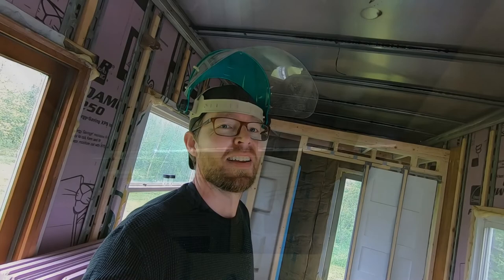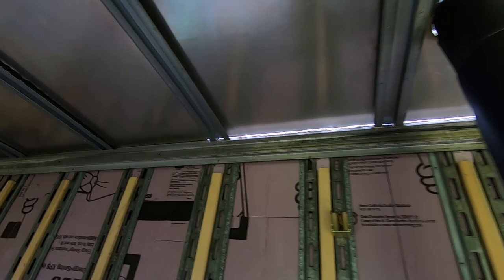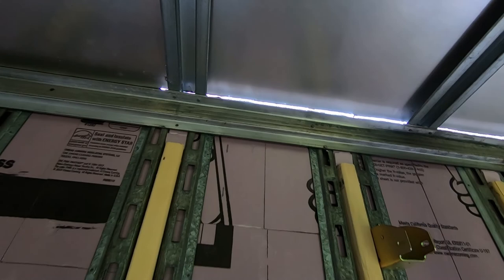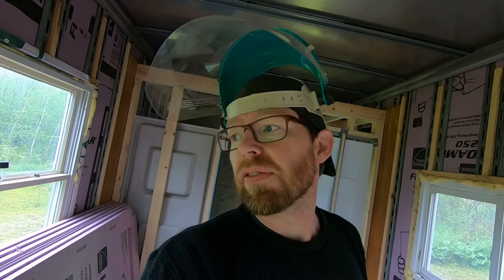You know that temporary business that I did and said earlier? Well, the temporary chimney is coming down. I'm closing in on the one side cutting. After I get the top cut, I'll have to go in and nip the rivets on those cross members. Then I will likely zip across the top and take it out in like 5 foot sections, I think I could lift. I'll test it, but it can't fall through because it's sitting on those ridges. From the inside, I'll stand on a ladder and lift it off and push it off into the yard.